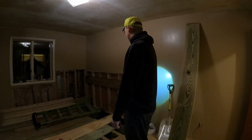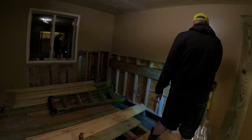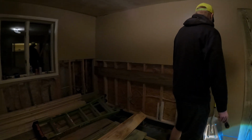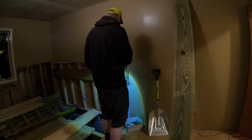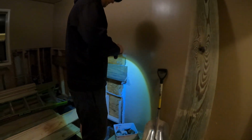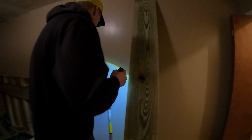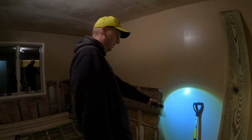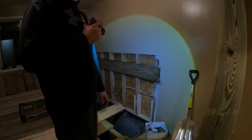So today I started outside, and I tore off this outside wall. You can see where there's OSB now. Our walls are two 2x4s thick, and this first wall is here, as you can see. The second one is rotten out, and I probably tore it back to here somewhere, the other side of that. There's 16 feet that's torn off, and it's 8 right there, so it goes another 8 feet. And then we put some OSB and plastic on the outside.